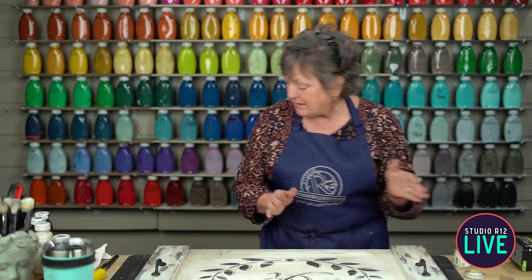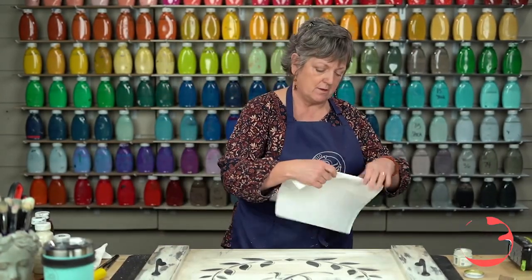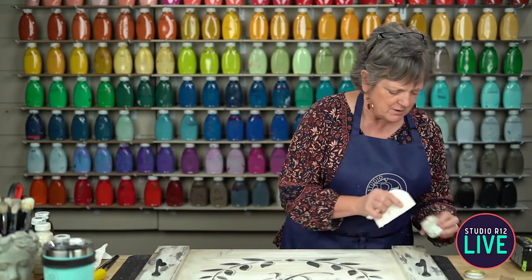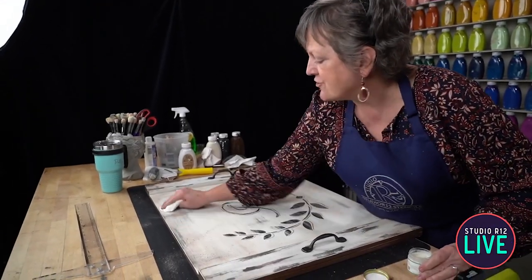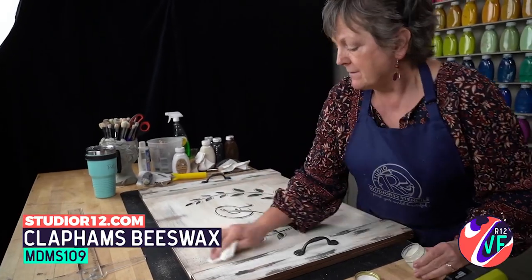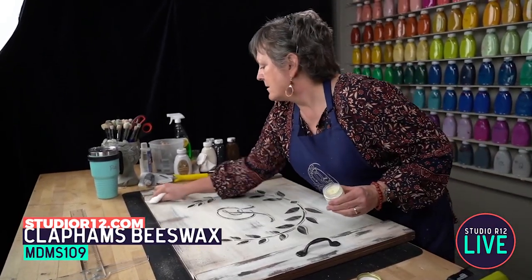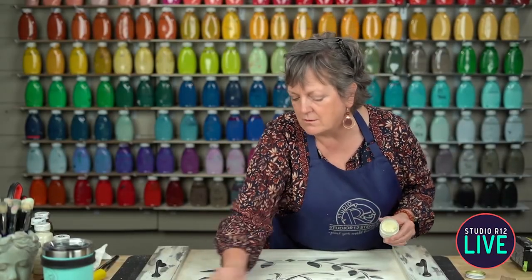And so we want to be food grade. We're going to be rolling our noodles out on our noodle board, or kneading bread, so we don't want to put a bunch of toxic chemicals on there. So you take your paper towel, a shop towel would be a better towel to do. You pick up a little bit of your wax, and you're just going to apply an even coat of your Clapham's beeswax. It is all natural, all the right things. And then you're just going to apply a thin coat.